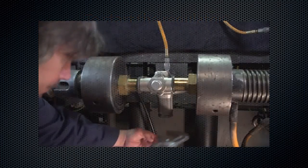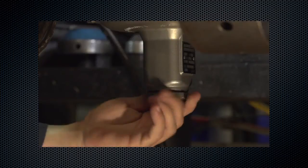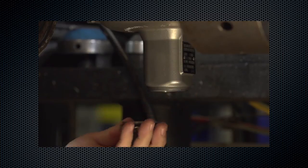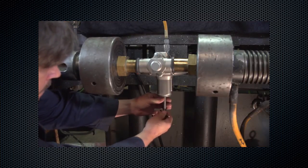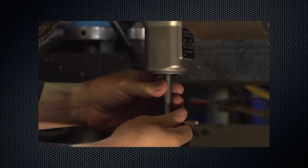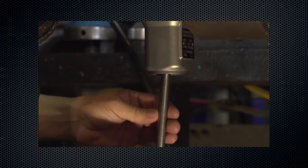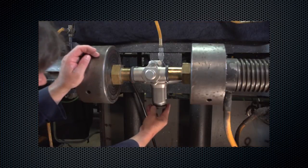For the internal flat circular adjusting screw, remove the closing cap. Turn the adjusting screw clockwise to increase outlet pressure or counterclockwise to decrease outlet pressure. Tighten the lock nut, replace the closing cap gasket, and install the closing cap.